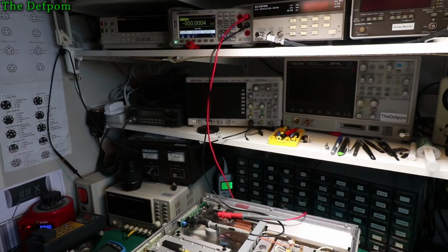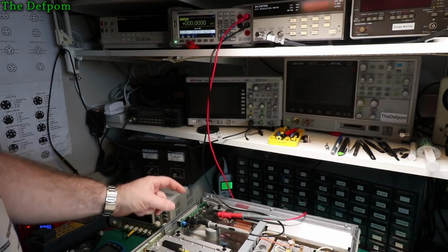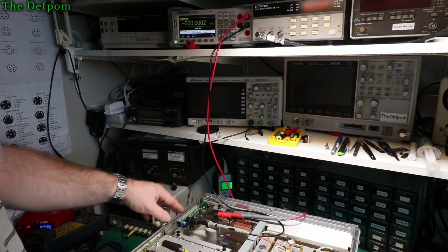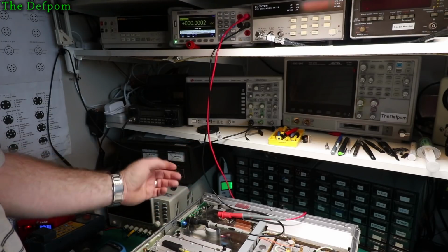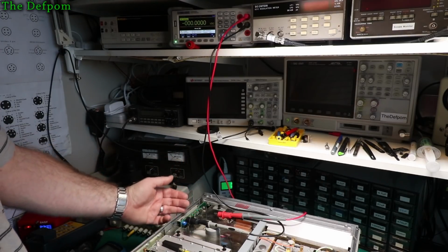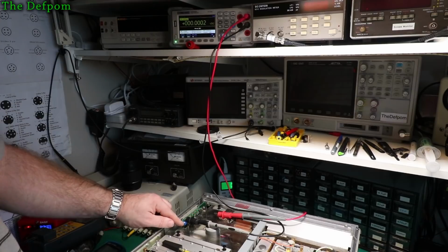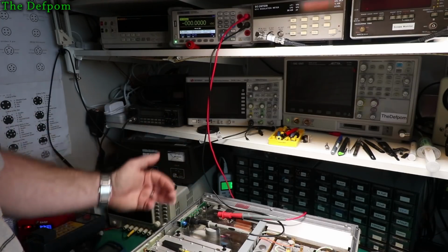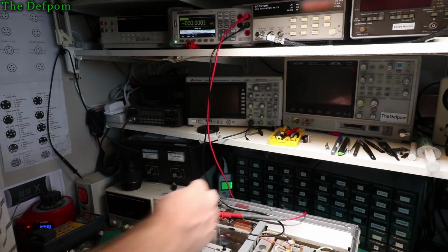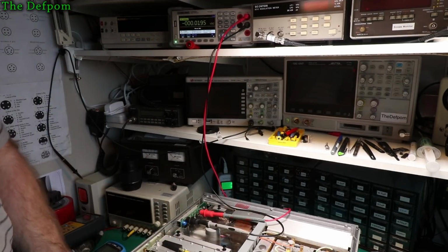Right, so if I'm looking at the circuit diagrams for this thing, which I may remember to show you if I recalled that, the plus and minus 15 volt supplies go to some op amps which are part of the 5 volt regulator circuits. So it's got some voltage comparators or something in there. So if the 15 volt rail or minus 15 volt rail is a bit out of spec, it may affect the 5 volt rails. So I'm going to remeasure the 5 volt rails, tweak the 15 volt supply, see if I can get those 5 volt rails in spec, and then go back and look at the 15 volt rail and see if I can get all the rails in spec at the same time. So I think it might just be influencing very slightly. So let's try that one there first.